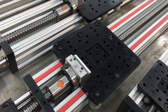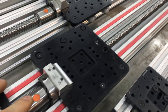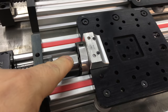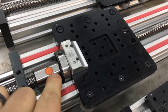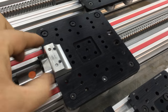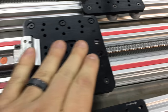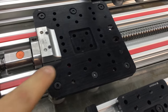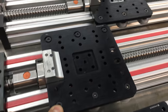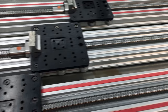Let's talk about speed versus accuracy — or accuracy over speed, the way I want to think about it. These are not fast. They're not meant to be fast; they're meant to be super, super accurate. They have anti-backlash ball nuts, which means they're pre-loaded inside. The pre-load pushes on both directions of the ball screw at the same time so it does not move back and forth — that eliminates backlash in the gantry plate movement. The travel speed is about 1,500 millimeters per minute, and that's not snappy — it's not meant to be snappy.